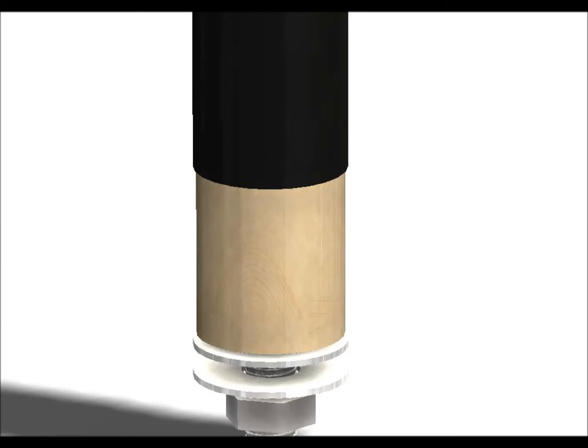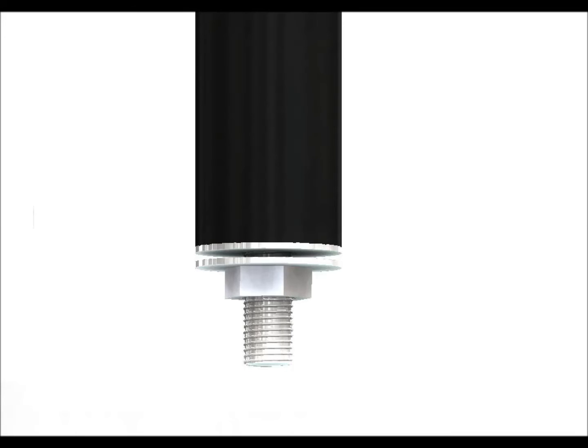The conduit needs to be around about 61 inches in length — that's 1550mm. I'm going to use a blowtorch just to lightly heat the bottom end up; I don't want to go overkill. You might even be able to do it with a paint stripper heat gun, but I used a blowtorch to make it malleable to allow the wooden block into the bottom. I'm going to slide the wooden block into the conduit flush to the base, and when we tighten the washer it's going to be flat against that block of wood and against the base of the conduit. Allow it to cool — if you need to straighten it while it's still malleable, you can do that.